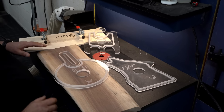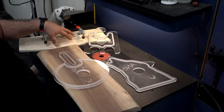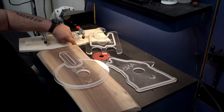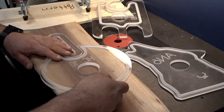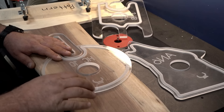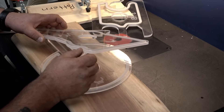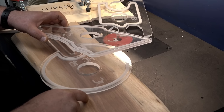I have the same rule for patterns. I never go under a half inch when making patterns. You don't need to see through patterns because the wood goes on top of them, but the thicker the better and the smoother the better. Having a nice smooth, well-sanded pattern matters because any little imperfections are going to translate into the material you're cutting — especially when you're using smaller pilot bearings.